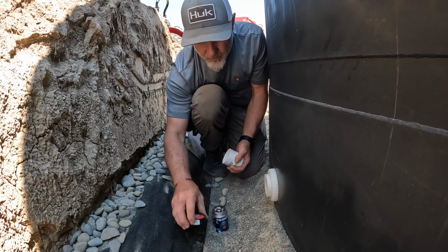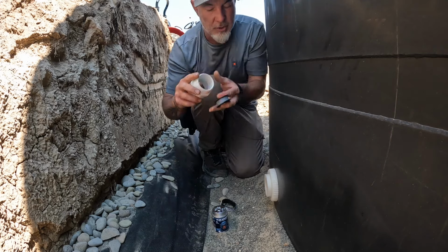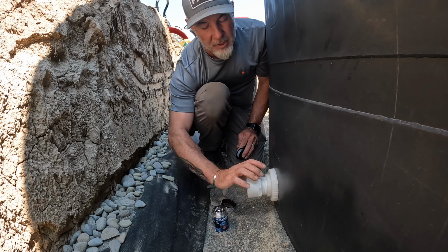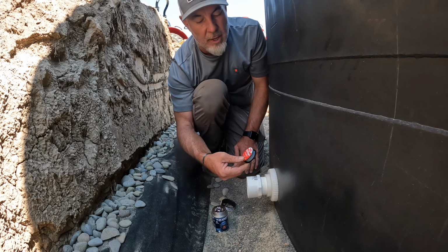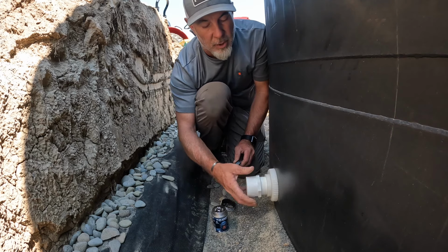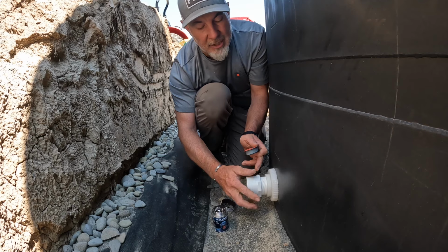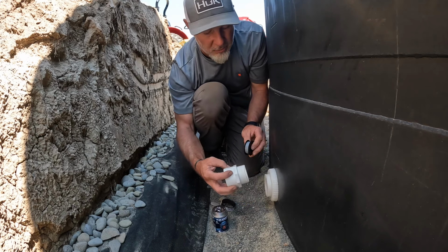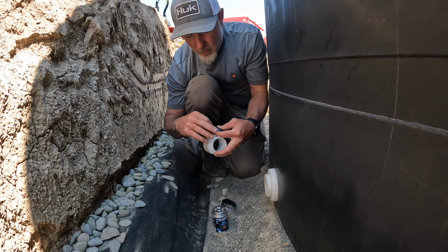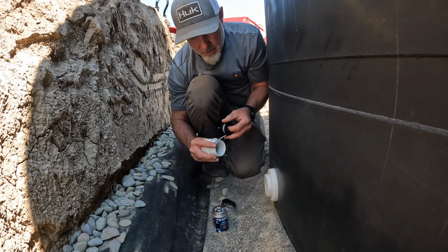and then we'll glue our valves on after that. So I'm gonna go ahead and put the tape on first, and when you do this tape, you can see which direction that you need to run this fitting to go into it, and you want to run the tape the same way. If you ran the tape the same way, I should say, it would actually peel off. So you kind of want to run it the opposite way so that when the tape ends and you start threading this on, it's actually going to hold the tape in place. A plumber buddy of mine told me that. So I'm going to go ahead and put this tape on here and then just try to think about the way that the threads are going to run in to that pipe. And I'll go ahead and do it.